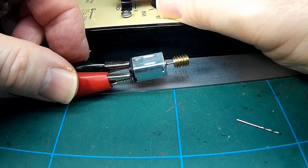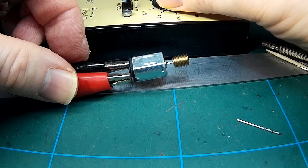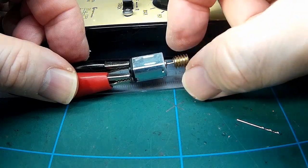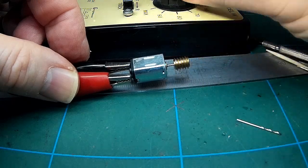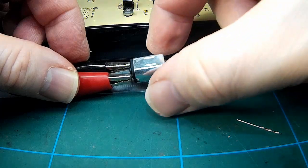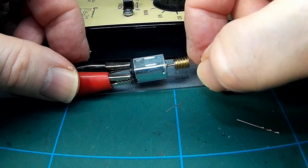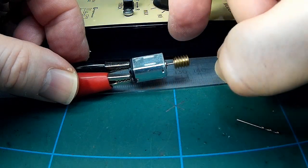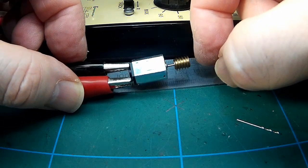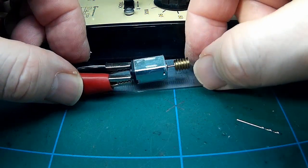Okay, so I just measured the milliamps drawn by this motor, and it's mid-speed range. It's drawing just 15 milliamps. 15 milliamps. Most LEDs run at 20, so that's quite incredible. Now, oddly, I tested one of the Chinese motors, and that's drawing about 22 milliamps and seemed to run a bit faster. So, caution, even though they say it might be 6 to 12 volts, they're probably nowhere near, probably much lower voltage. So it's really worth, if you're going to source your own motors, looking for something 12 to 24.